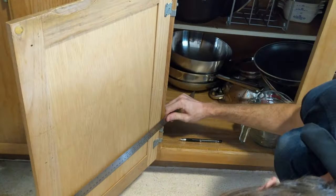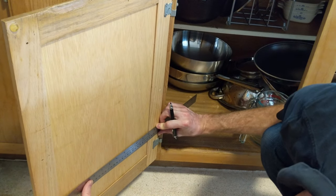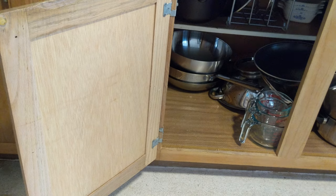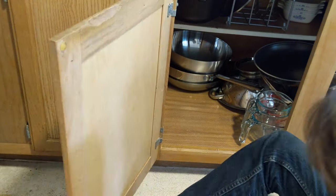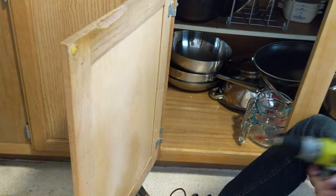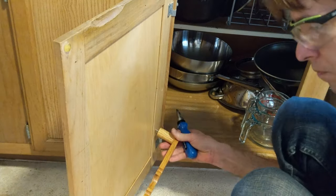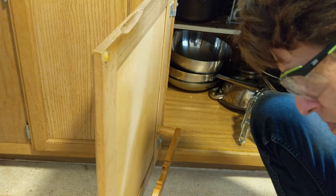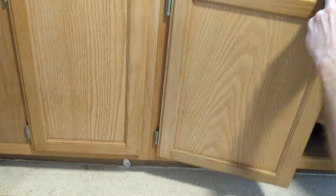There's a design challenge here. These are frame and panel cabinet doors, and you really want to screw into the frame, not the panel, which is very thin. That means you have to fit the dowel, plus a little for the extra diameter of the crossbar, into the width of the frame minus the amount of overlap the frame has over the opening behind it. Also you have to use some trigonometry, because the lid hanger also sticks out from the frame, so it's really the hypotenuse you have to worry about.